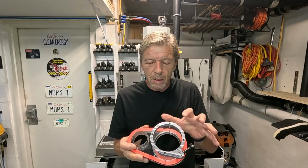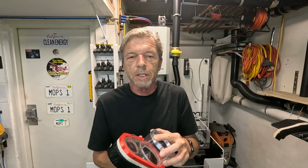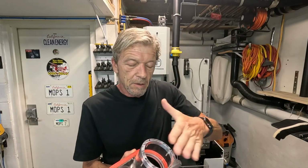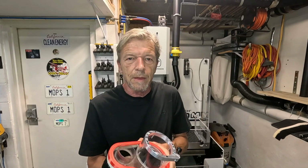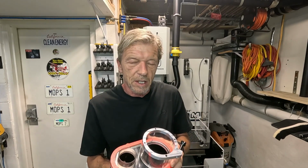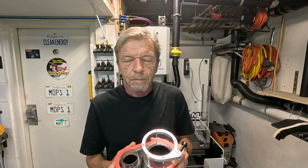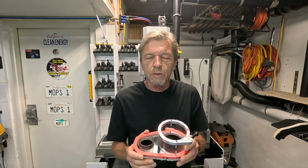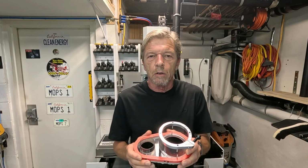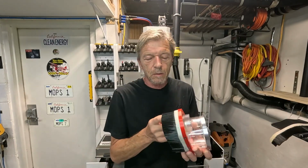And in my first video I built this clamp by machining the bottom side first on my CNC mill and then facing off the clamp on my lathe, and that process was not very satisfactory. For this version I did that also on my CNC mill. I made some soft jaws for that, and I'm going to show you how I did that on my CNC mill. Okay, let's start with the brush.